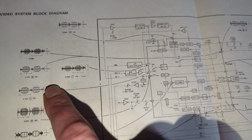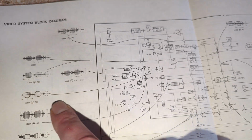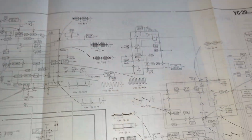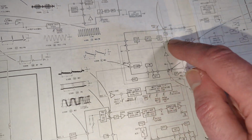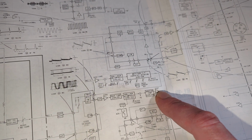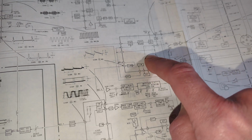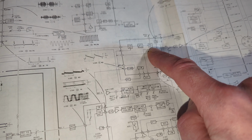It's up here. So obviously I wasn't getting a waveform like that, but here it was. I was getting recording fine. So it's processing the signal going back through. There's a switch inside the chip, but there was no playback. But I was also getting an input to pin 38 here. So something has gone wrong, by the looks of it, internally to the chip.